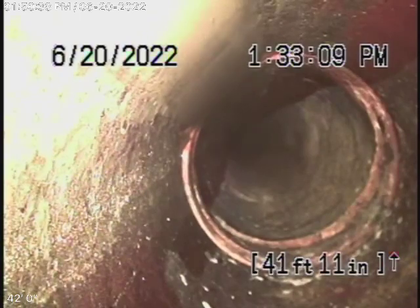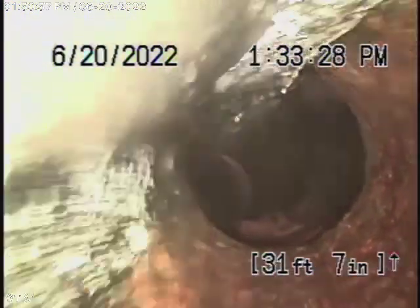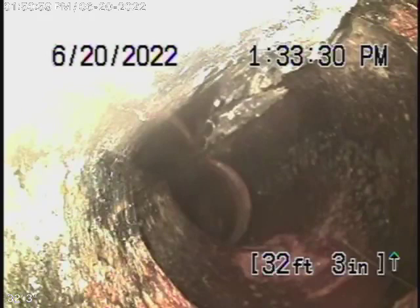You can see a crack there at the hub, and another crack here around the hub. Now the line is maintainable — there are no issues in it right now, it's functioning. Two minor stress cracks in the clay pipe: very common, very normal to see that.